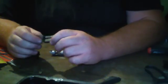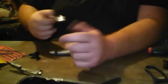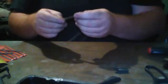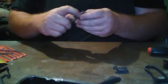That's pretty much burnished in. This gun's from '64, so a lot of the stuff was already pretty much burnished in, and a lot of the little scratches and machine marks, I don't know how well you guys can see that, but you're not getting them out. They're not coming all the way out, not without changing the design and possibly going too far. They're probably 5 or 6 thousandths of an inch deep, too deep. So as long as you can't catch them with your fingernail, you're good. Okay. All right. So let's put her back together.